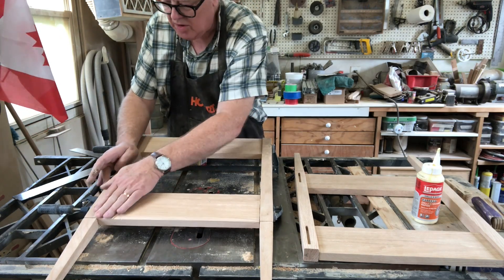There will be a little bit of joinery for the shelf. I'm not going to put any screws through. What I'll be doing is using little figure-eight clips — they'll mount to the underside of the shelf so it'll hold the shelf on. Same thing with the top. There will be a figure-eight clip mounted to the top of the side rail and then screwed up into the bottom of the shelf. The reason for that, of course, is to cater for expansion. These are likely to expand and contract a little bit with humidity, moisture, and temperature. As a result, I don't want them fixed onto the top legs — they need a little bit of room to float. The drawer slides are going to require a little piece of filler to go in here, just so we get clearance to get the drawer past the leg.